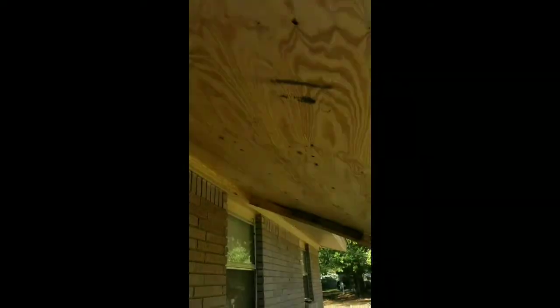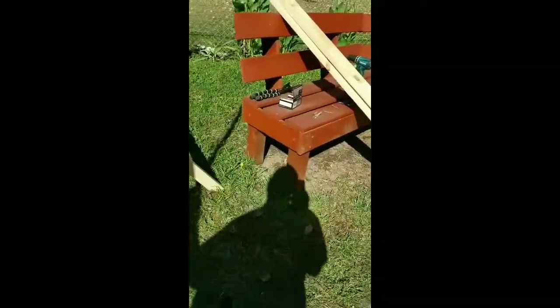I've got the roof part on. One bit of advice: it's very difficult to get that roof up alone — two people would be ideal. I had to brace one side with extra wood, then screw the other side. I ran along the top and put in a couple screws for now — I'll add more later. Next, I'm taking the outside base and the legs, which I trimmed down about a foot to roughly seven feet. I'll screw the legs into the anchor board first, then put the whole assembly up.